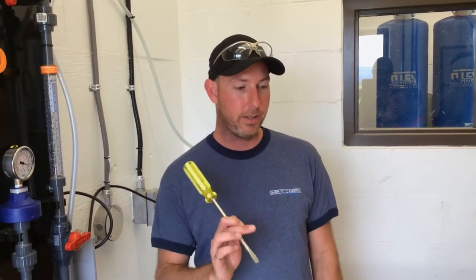Slow, instead of going dose and waiting 6 seconds, I'm going to discharge for 6 seconds and then suck in. And then discharge for 6 seconds and then suck in. So you get a much more continuous dose going in when you're running at low strokes. That's what slow is. It also makes it very flat.